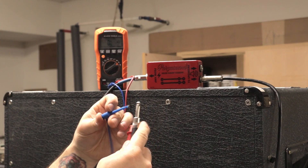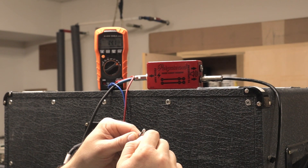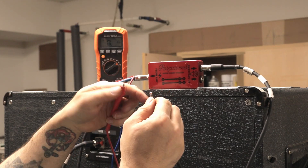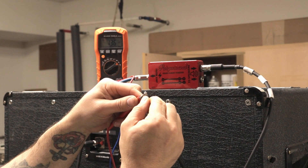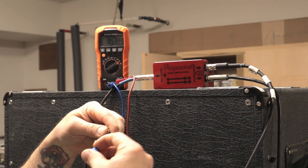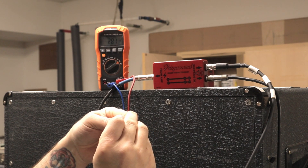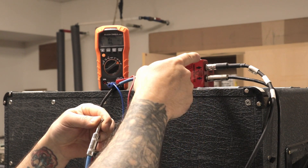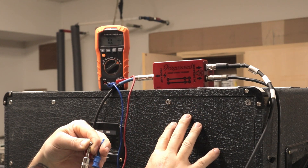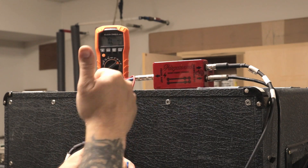This is just connected to another Marshall cab, and I've got 14 ohms on that cabinet — and this one is about 13.6. Let's go ahead and plug them both in. With both together, we have 28 ohms, which is good. We should have 16 and 16 in series, so we should get 32 on the other side. Like I said, that's impedance, not resistance — so each speaker will never actually read its rated 16 ohms; it's always going to read something slightly lower. The fact that we're getting 28 here with these two plugged in series means everything's working like it should.